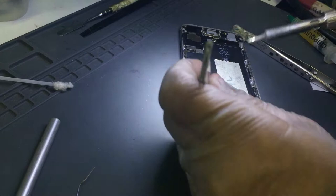Okay, so that's going this way. Just did a backlight before that as well. It was a water damage phone. The problem with that was a water damage dead shortage, and that was a shortage on VCC main, and that had a problem with the Q12 IC. So what we did on that, we removed that IC.